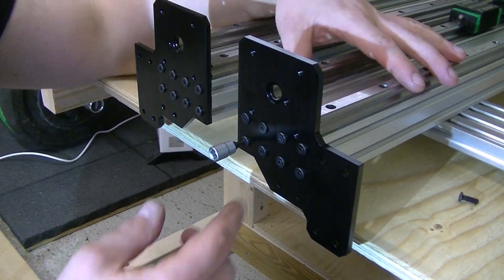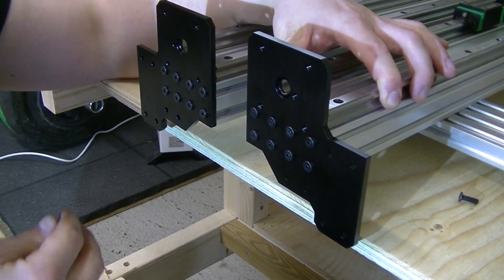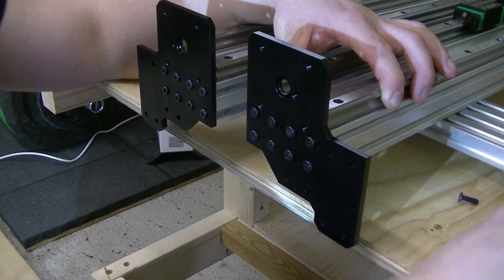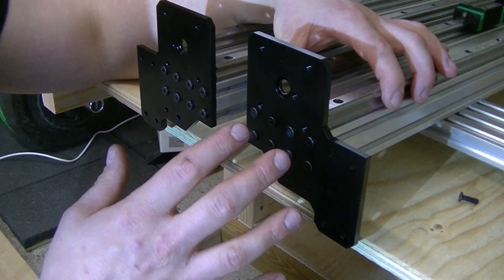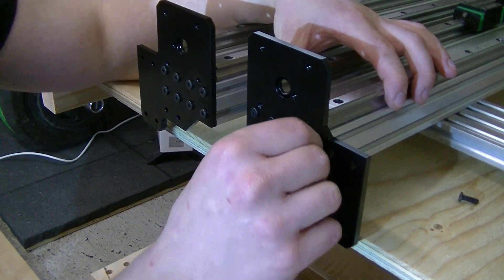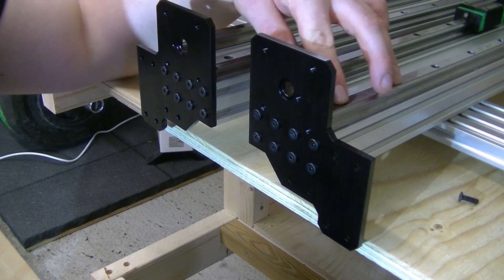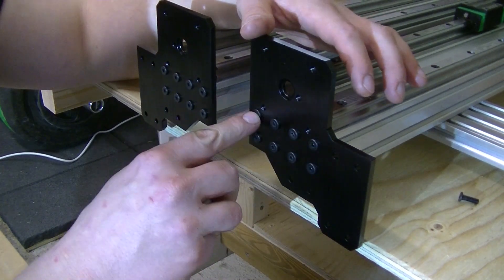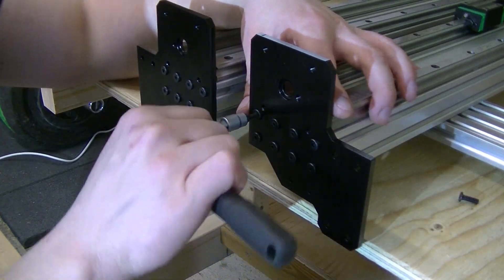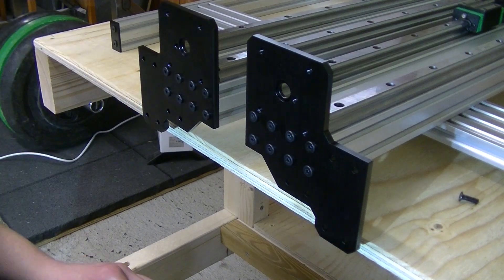Just a quick note about installing this plate: almost all the screws in this kit so far are poor quality. This is a decent Proxxon tool, but these screws are made from cheese or something of equivalent hardness — I've managed to strip the hex heads on about 80–90% of them without even trying. The only ones that have been okay are the ones used to hold the linear rail in place. So if you want a really high quality assembly, I would suggest changing out all these screws before you start installation.